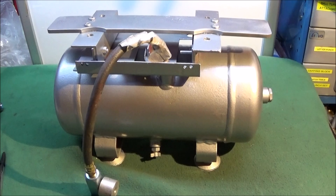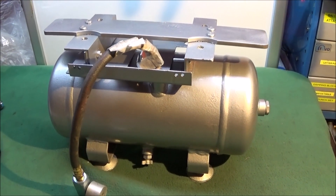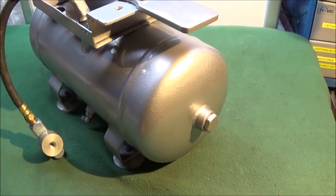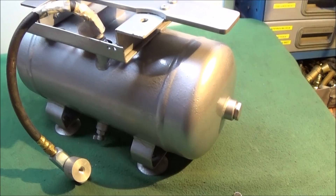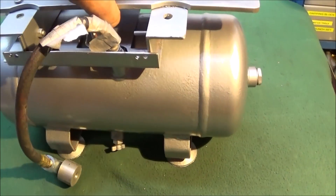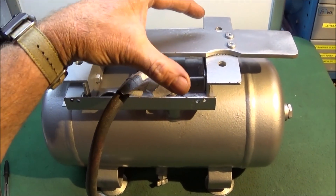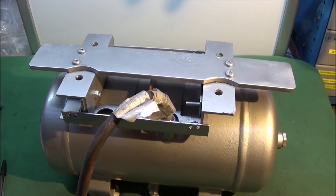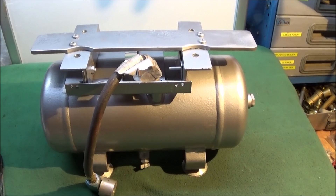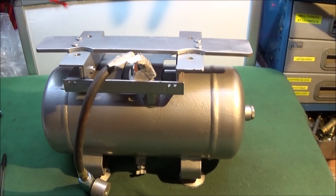This is another small project I'm working on at the moment. This was another noisy 90-decibel compressor — an old one — but I took the end cap off, had a look inside with a torch, and the steel looked as good as new and very thick. So I thought I'd make this one into a nice little silent compressor. I've resprayed the tank silver — it was red — and bolted an aluminium plate on the top, drilled to accept a fridge compressor which I'll be mounting on there. I'm waiting for an automatic switch bought cheaply on eBay, and a little regulator, and then I'm going to bolt it all together and hope to show this one at a later date.